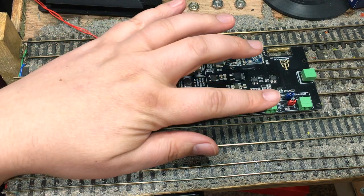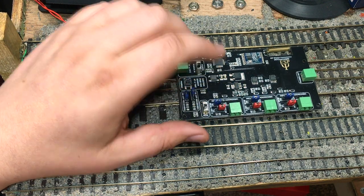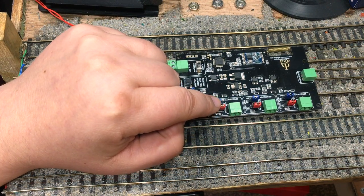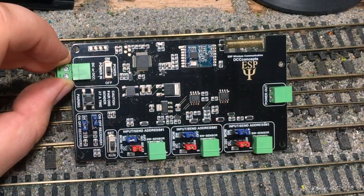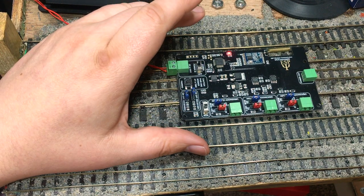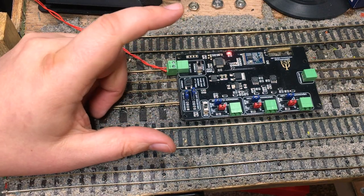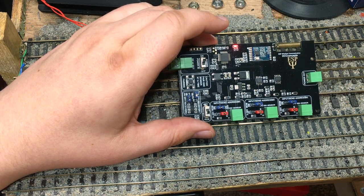I just want it to communicate back to the single receiver, so I've set these accordingly. On each of the three channels we've got two options for each channel. The top one is what type of switch is going to be wired in here, so you can either have momentary or on-off. I've chosen to go momentary for channel one and then on-off for two and three. Underneath the red ones, these are whether the inputs are going to be zero voltage or powered. Each of these are going to be completely unpowered, so I have set those jumpers to the zero volts option. We can now turn the unit on and for pairing, it's just simply a case of pressing the pairing button on both this and the receiver, and they will find each other and they will remember that setting. Once the light has gone to solid on, that means that they have paired quite happily, and you're ready to go.